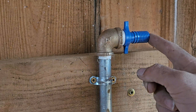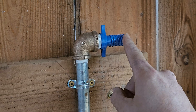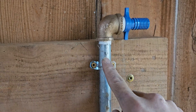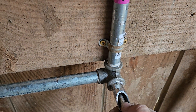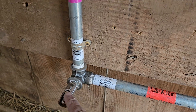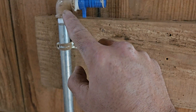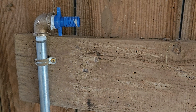This is where our poly line is coming in — we're using three quarter inch poly line. We've adapted from the poly line to steel fittings down to our half inch steel pipe. Now we have a three-way elbow at the bottom, pig nipples, going over to a second pig nipple, and then the return line going back up to the same fitting where the poly line will go out to the next stall. That's what we've got to work on next.